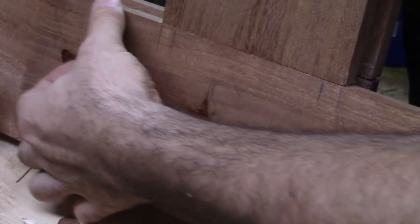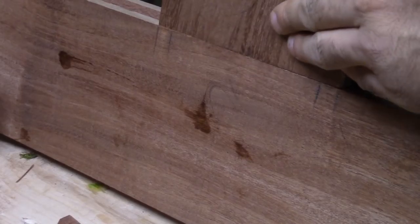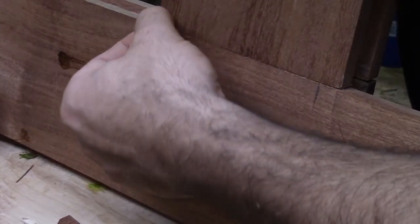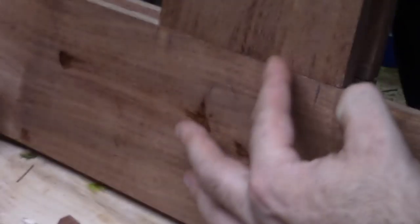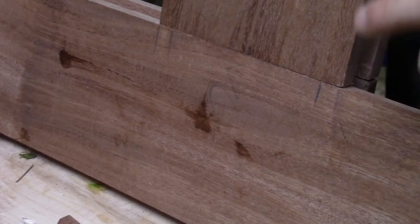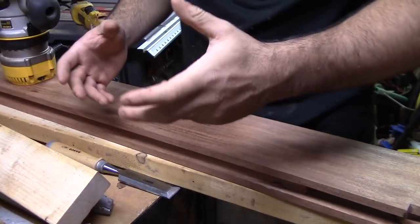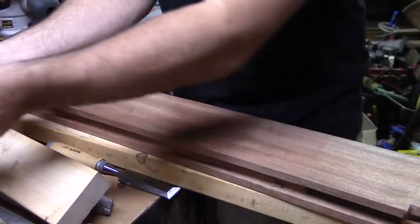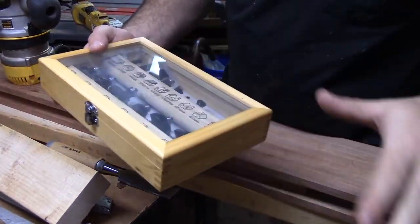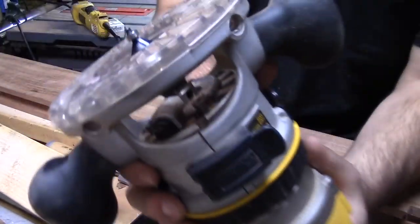So let's get started. This is one of my better joints from the vertical piece to the horizontal. The gap is almost beautifully perfect and it's really flush. It's a little off right here, but not all of them are that perfect. I have some that are just a fingernail gap. That's the biggest mistake I have, but it's not that big of a deal. I'm going to chamfer this whole edge right here, and I'll chamfer the edge on this board on the horizontal piece too, and it'll soften this and you won't notice it as much.